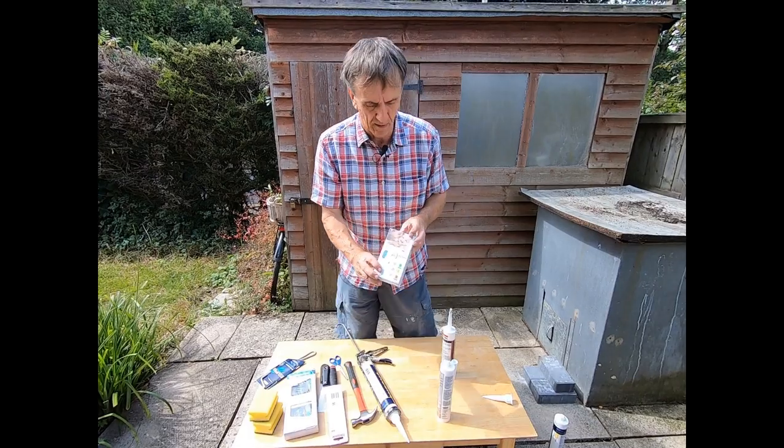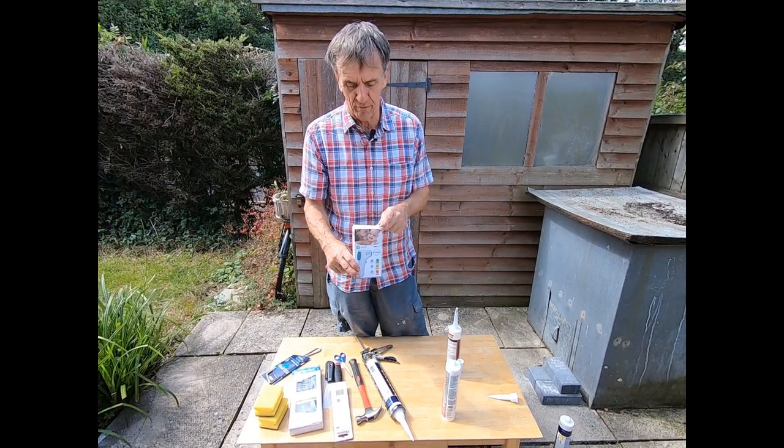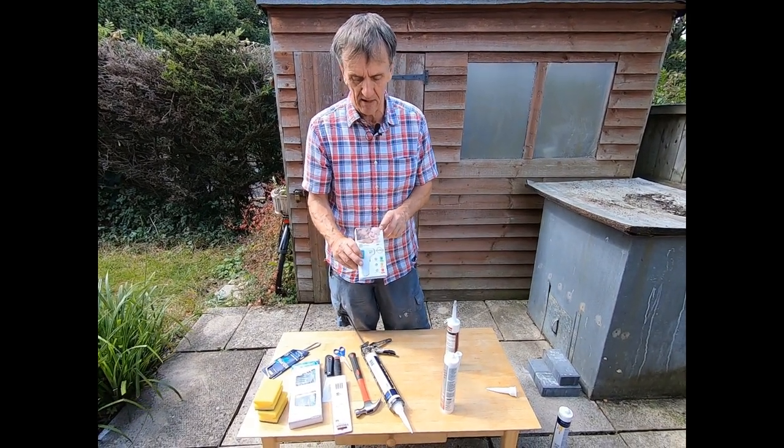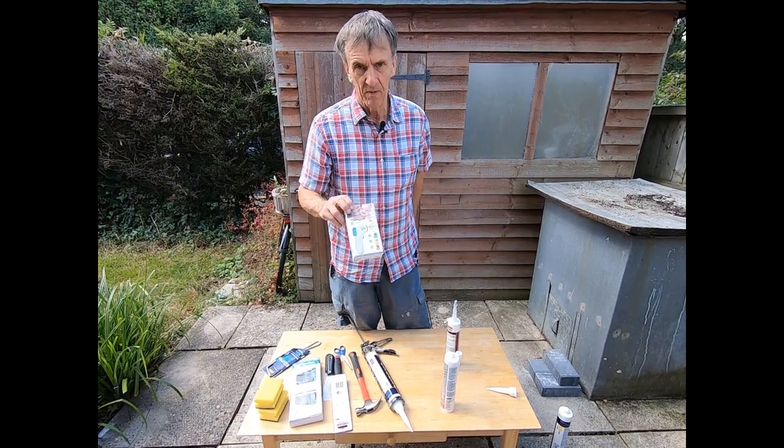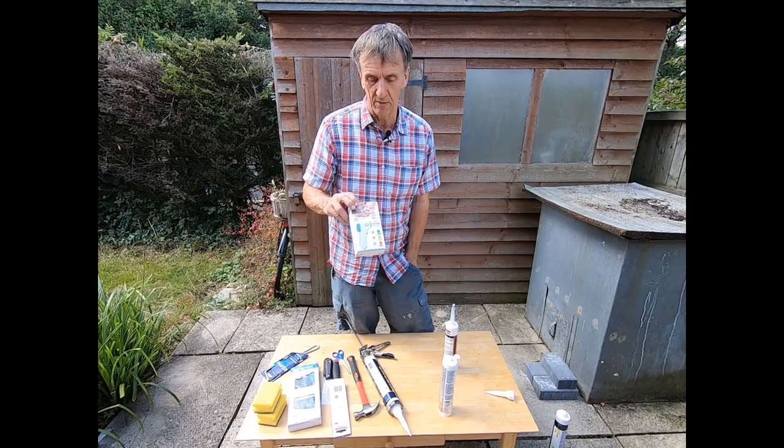We also give you a little infrared thermometer which picks up temperatures. If you're finding very cold places, that's an indication of either missing insulation or a draught. It's very useful on loft hatches to tell whether they're insulated or not, without even opening them.